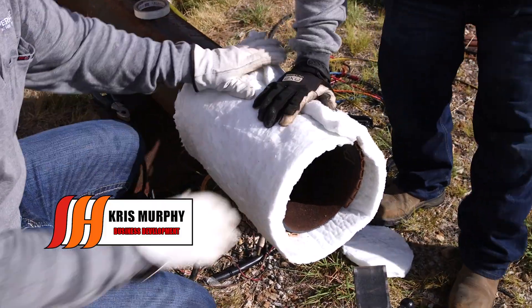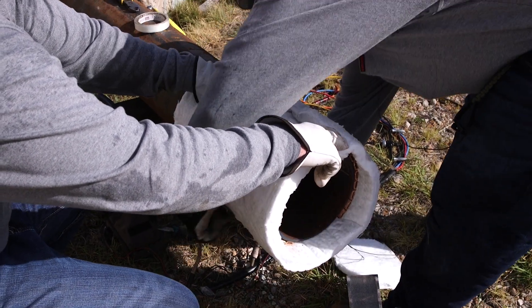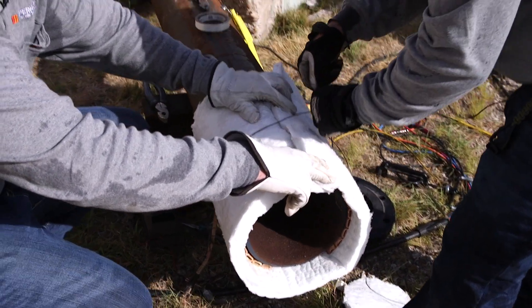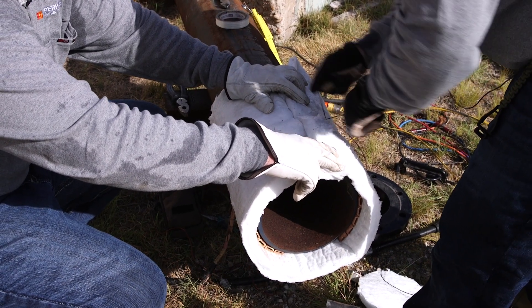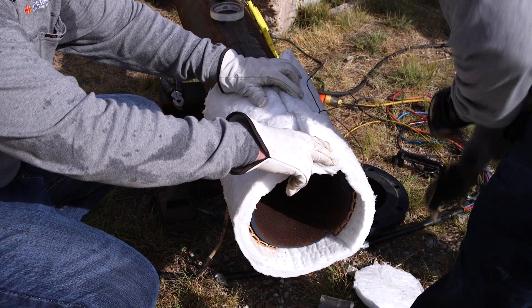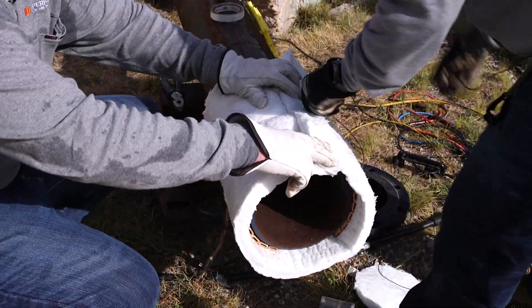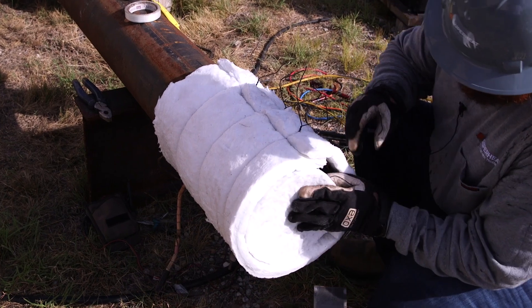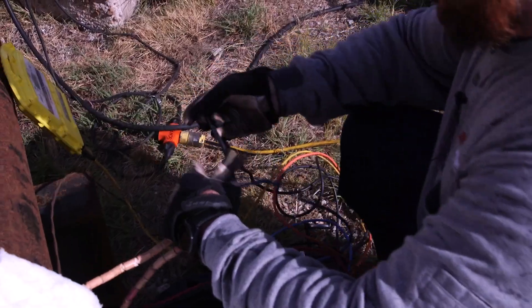So when we get to welding this flange on, it's gonna help with reducing cracking and any brittle material that's left in there. On our bakeouts, these existing lines — whether it be from a refinery that might have petroleum product running through it, or maybe a power plant that's gonna have natural gas, high pressure running through it — hydrogen gets embedded in the walls of these pipes. So when we ramp it up to temperature, we get rid of all that hydrogen so it alleviates safety issues plus makes a better welding surface.